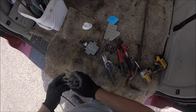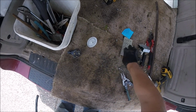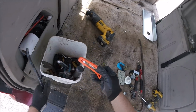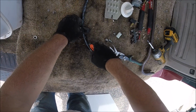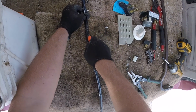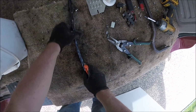So what I'm gonna do is load up that aluminum that I cleaned yesterday. I find if I clean this stuff first on the outside and then use my stripping machine, it cleans it way better. Otherwise, the way it's twirling in there, it actually gouges the next wire when I put it on the strip machine.